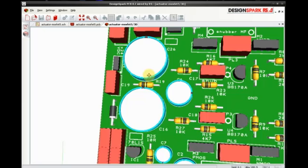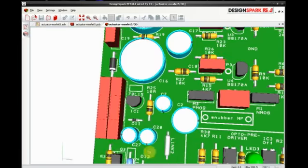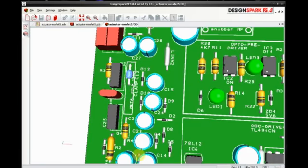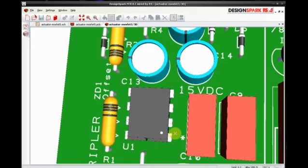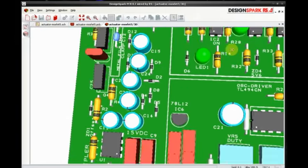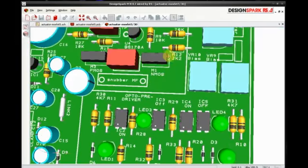They're just the reservoir capacitors, which the MOSFETs will pulse, sending 2 or 3 millisecond pulses out to the coil, and it will take that energy from the capacitors. Then we've got like 40, 50, maybe 60 milliseconds for them to recharge from the charge buffer down here, which is all these little capacitors down this area, driven by a timer, an NE555 of all things. So anyway, that's just a little update on what I'm doing at the moment.